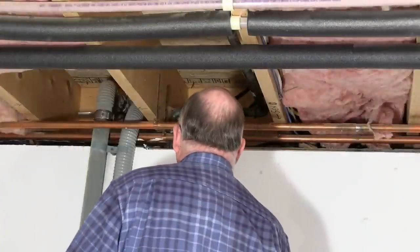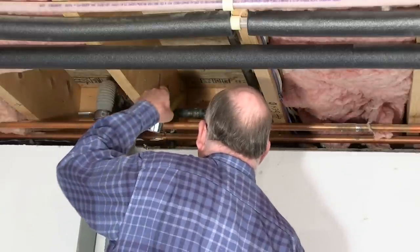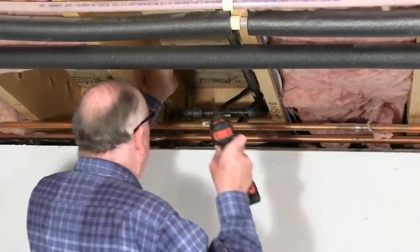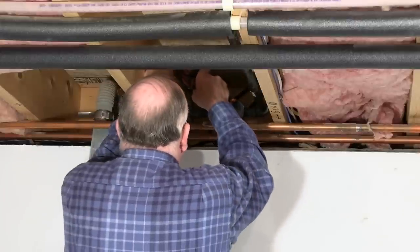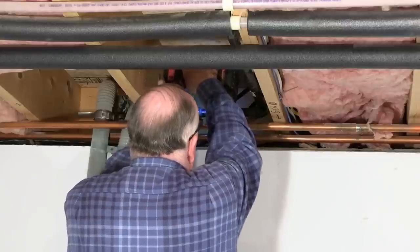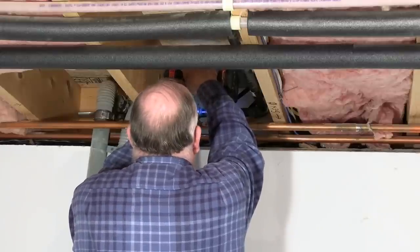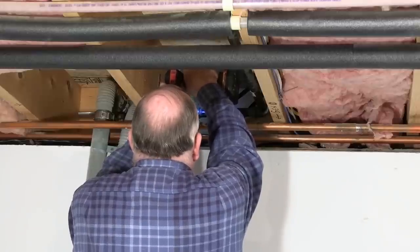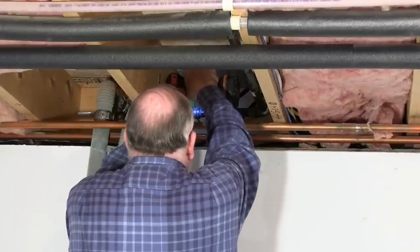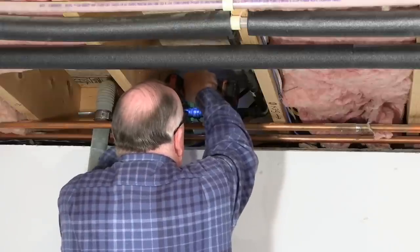I'm simply going to take the tape and go inside, bend it and lock it in place so it doesn't slip back on me, just go back into that corner and bend it into position. I can see very easily where I need to be, and just bore straight out through — making sure to keep parallel to the floor. I'll back it out a minute to clear out the wood.